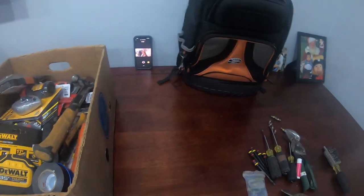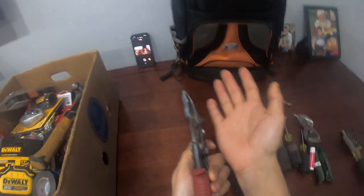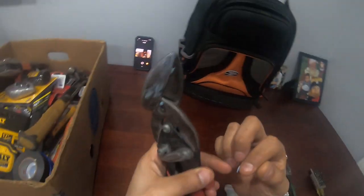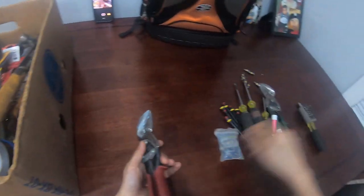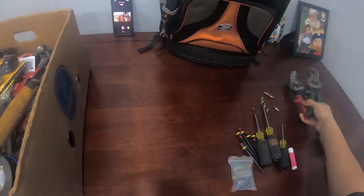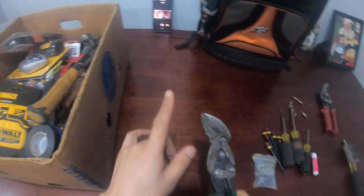First things first: my metal shears. You don't want to get the straight ones, you don't want to get the yellow ones, you don't want to get them from Home Depot. These are the best ones — oh man, I just cut myself, look at that, real sharp. They're 45 degrees. The red ones are for cutting this way, the green ones are for cutting this way. These are the two shears I carry at all times, about $40 each. Only ever cut sheet metal with these — any nicks will show up on the sheet metal.